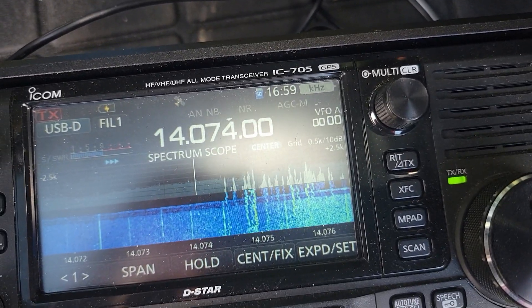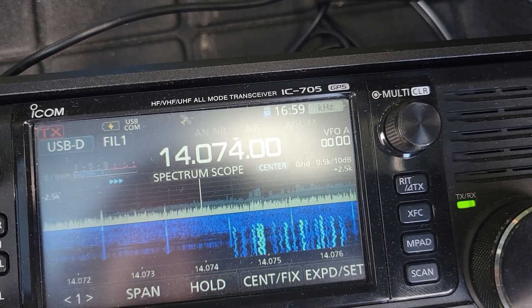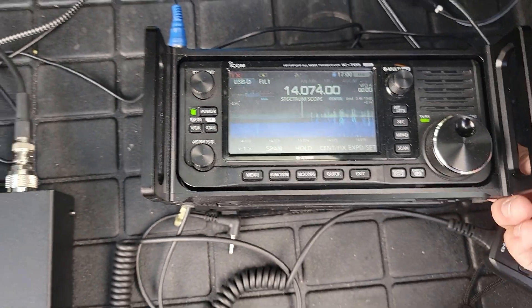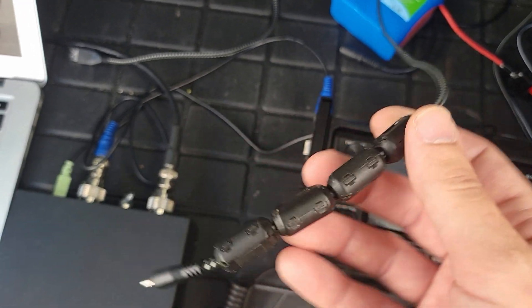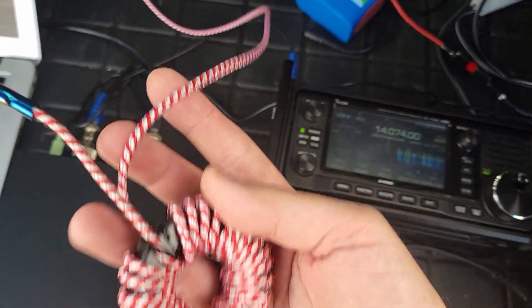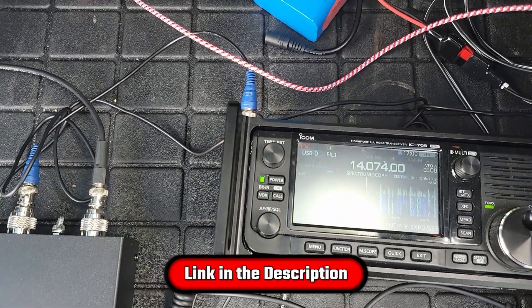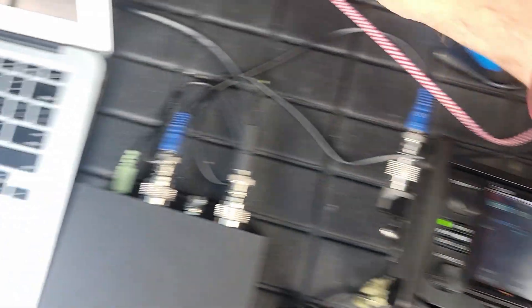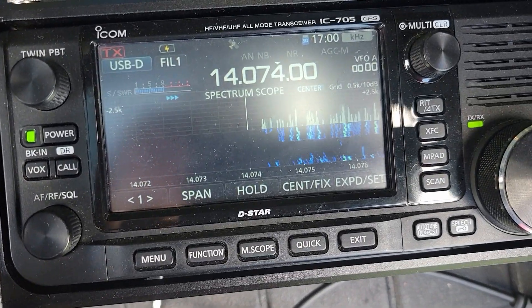I'm going to unplug the USB cable — poof, noise gone. Plug it back in — noise back. So if a few small ferrite beads aren't good enough — there are four of them there, and these are unknown mix, unknown variety, unknown everything — you can just get these on Amazon all day long as snap-on ferrite beads. If four of those aren't enough, how about we get the big boy out? This is one of those 10-foot long gas station USB cables with a 240-43 mix toroid. I'm going to plug that in. Look at that noise floor — nothing, solid.